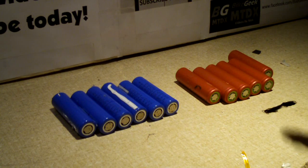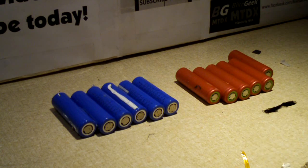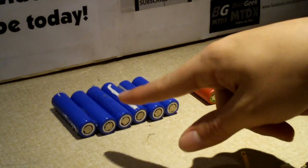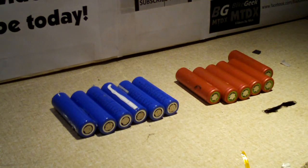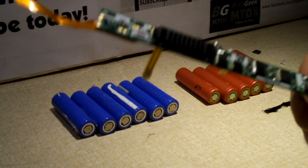I extracted these the other day. I'd done the Toshiba ones first, but it turns out they were all bad. I then did an HP pack and all of those turned out to be good. This is a common thing — laptop batteries go bad, but usually it's just maybe two cells out of the whole pack, or this little circuit board here could be the cause.